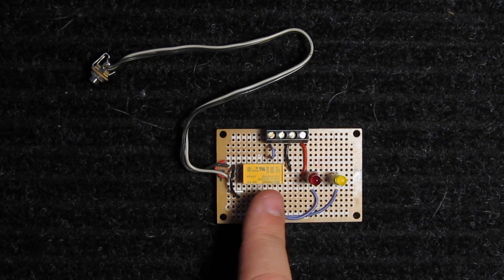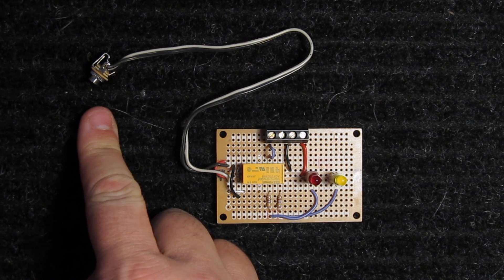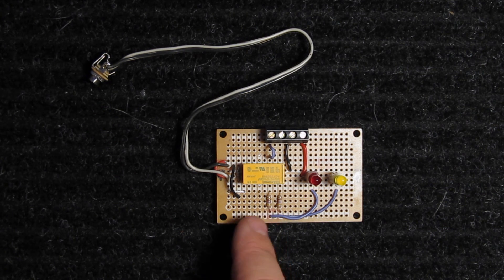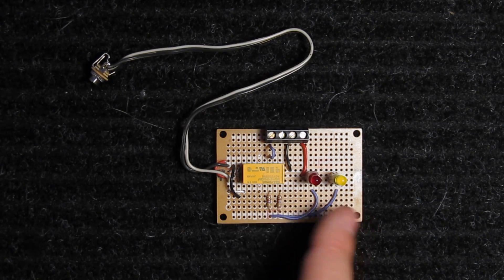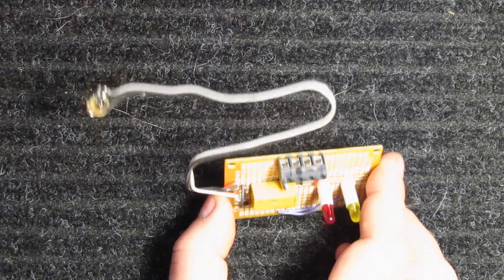So that is the relay. This little cable here is where I'm going to connect my probe. Since I had two extra outputs on the other side, I put a couple of resistors and connected it up to two LEDs so that I can see what the status is. And over here is where I'll attach it to the PC for the probe output.